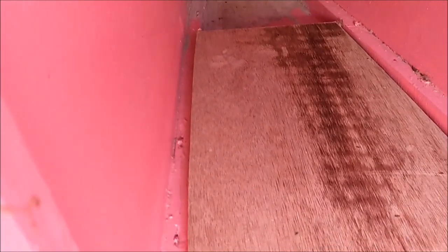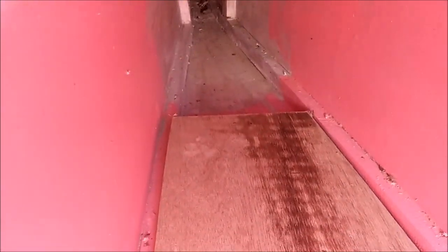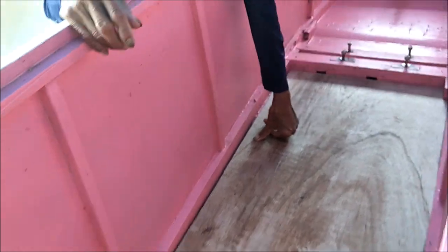All the way up to the front. Okay, about a half inch from the pencil. Okay, so we've got to trim some right here because it's a little bit short, but we did get it square. And from right here to there, we're marking. From right here, I need to shave up to the tip about a quarter inch. I'll just do a straight line, quarter inch up to the tip so it fits. And then the rest of it's okay? Close enough? It notches in the notches and everything's good?